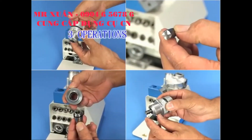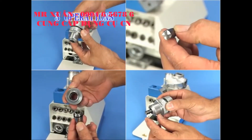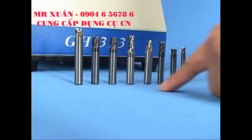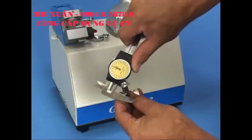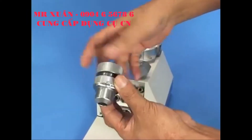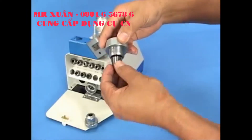Operation: Five steps of using the ReSharpener GH-313. Step 1: Set up the end mill to the ER collet holder. Determine the diameter and flute of your end mill, then select the proper collet and collet holder. Insert the collet into the collet holder.